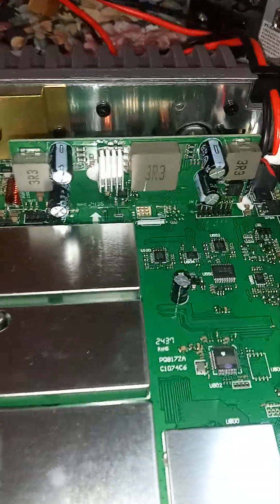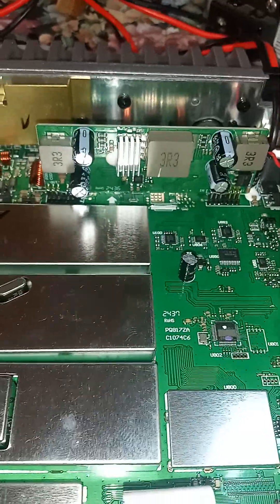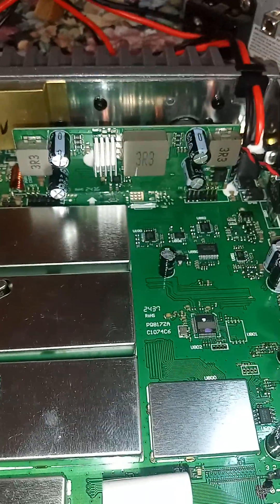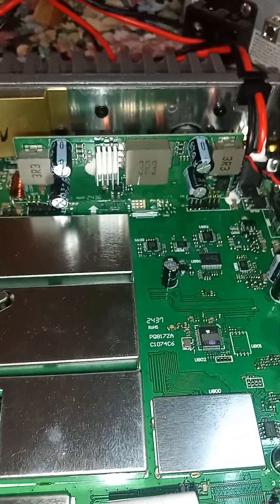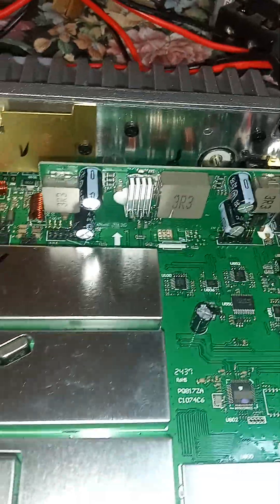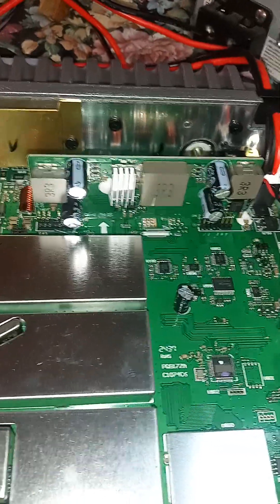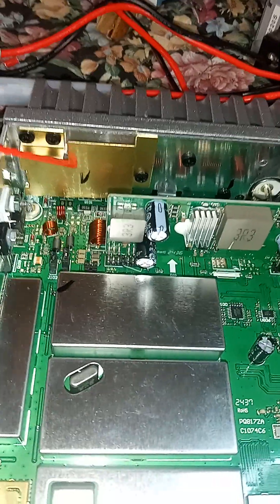You can also see this vertical board right there. You'll see these in the Stryker HPC Plus and also in the Washingtons — the new Mobile Washingtons that President is putting out. That vertical board jumps the voltage up to 20 volts on the finals that are behind that shield right there.